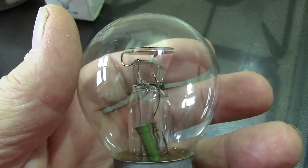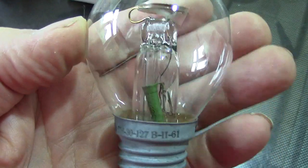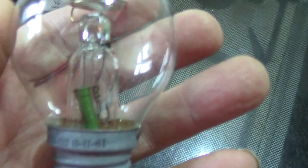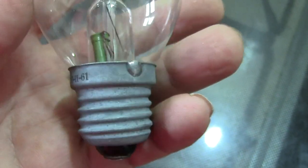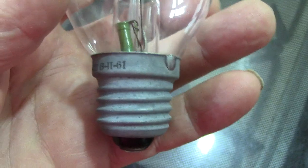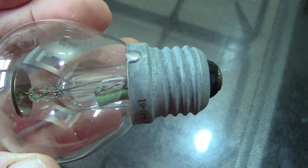These were made in the 110 volt range and the 250 volt range. The only difference being the little resistor, which you can clearly see wired in. It's not even soldered, it's just twisted up. Very poor, I think. The cap is made of this metal, which you can normally know if a lamp's Russian by the state of the base. It's got that metal which oxidises into a grey coat.